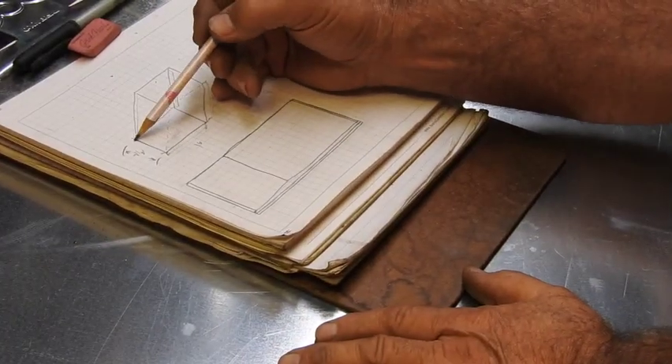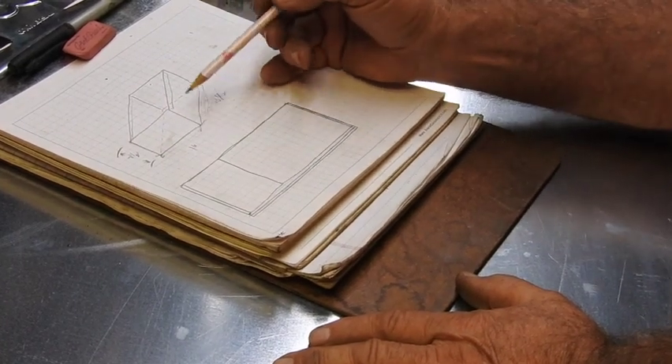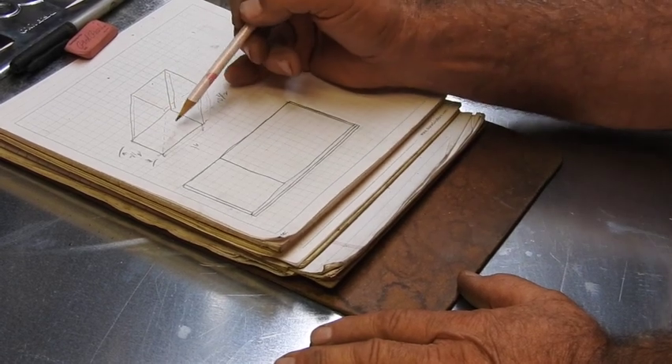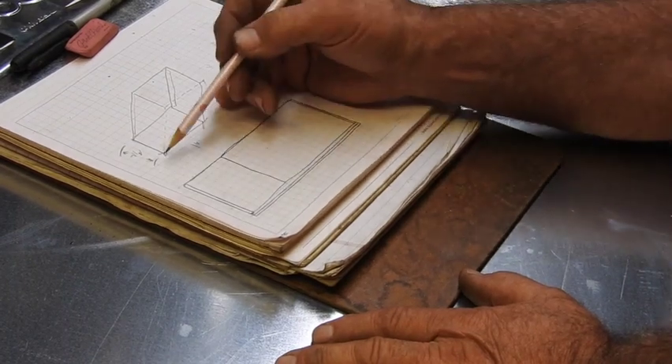Here you can easily see what I've got drawn out here: 7½ inches high, it's going to have a half-inch double hem flange all around the perimeter. It's going to have a drive on the 10½-inch dimension, and the 16-inch side is going to have the S's. You can see the dimensions are 16 by 10½ by 7½.